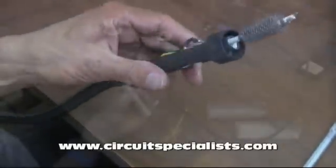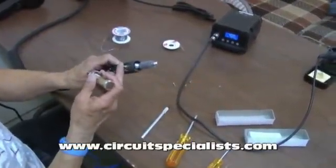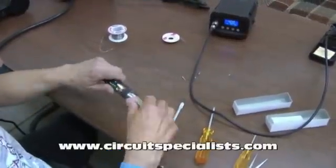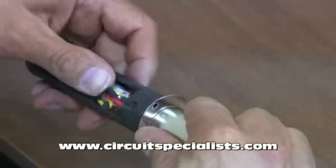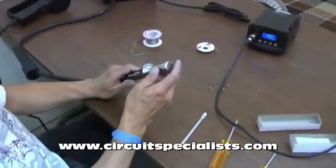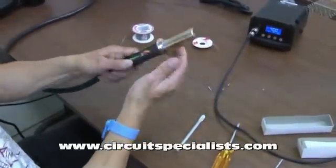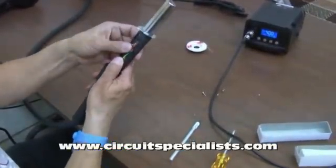Cut off the excess. Now I need to insert the wire socket here and make the connection with the wire pin that's coming out. This one comes in and out much easier because it has no solder on it — because there's no electricity flowing through it. It's just a ground for the ESD-safe feature of the unit. What it does is keep this metal shield grounded so that if you actually touch it to the board, it is grounded and you won't create any ESD events. Once I get it in there, I'll shove it back down as far as I can and make sure all my connections are solid — and they look good.